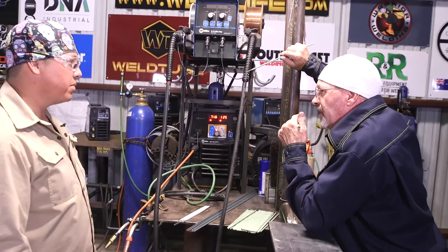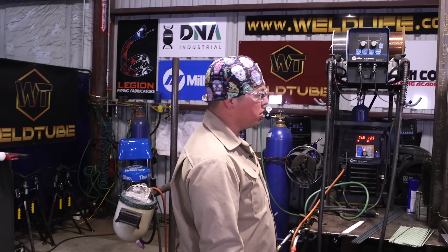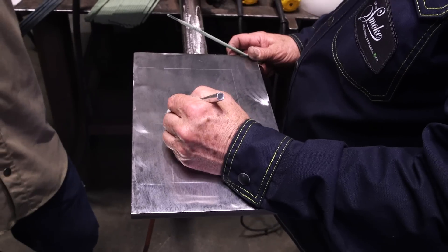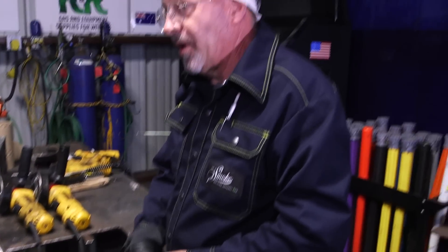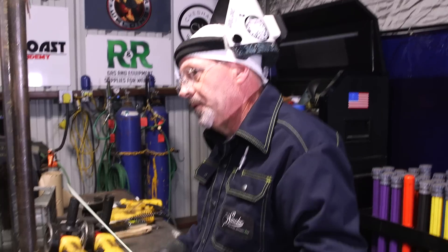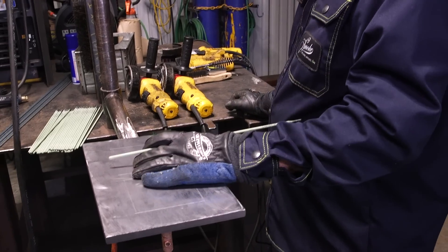So you haven't run this out of position? I've run it out of position — it does okay vertically, horizontally, but it does tend to dig and get a little hot. So we don't want to fabricate a bucket out of super hard material — number one, it'd be really expensive; number two, it'd be hard to work with. So we form it out of plain mild steel or carbon steel and we layer it with the goodies to make it effective and last a lot longer.